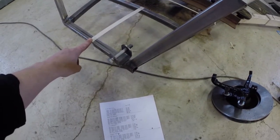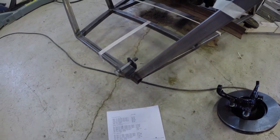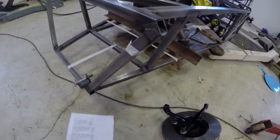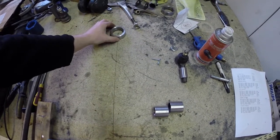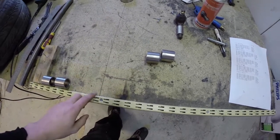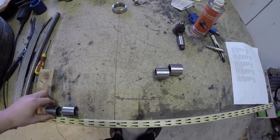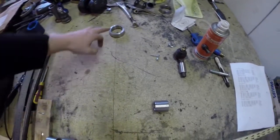For instance, the lower one should be from here and out here — that should be 219mm, and the height from the floor up should be 210mm. The same goes with the upper one. So what I then do is lay out the lower one first. I measured it up, so I have 480mm here. I then put this piece here, and I should put another bracket there as well.